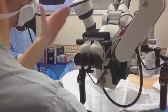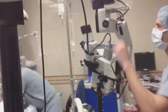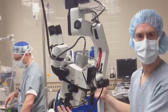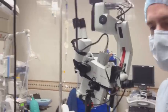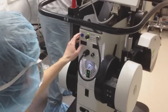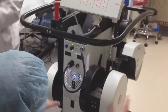Now you're going to need to do C, which covers the tilting side to side. You'll turn the rotary knob back here to C. What that's going to do is engage all the other brakes except the one that allows you to see how it's acting side to side. This is the C knob right here — it will shift the weight from left to right to balance. Right now it's not moving, so it's basically balanced. Once you confirm that, turn the knob back to D, the auto-balance system ready position.